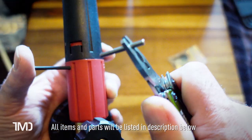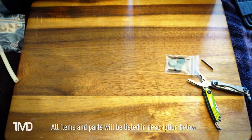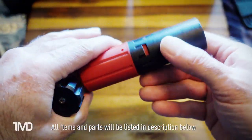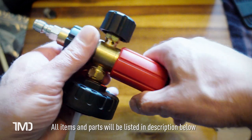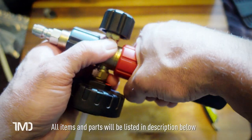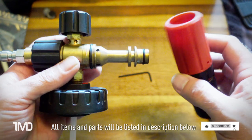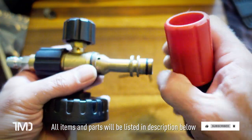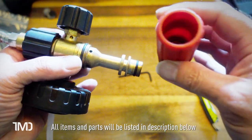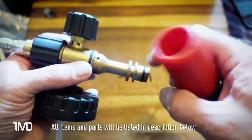Pull the pin out just like that. Make sure you set the pin aside so you don't lose it. Now that the linchpin is out of the barrel, grab at the base of the nozzle, hold onto the brass component, and twist back and forth while pulling. The nozzle isn't threaded — it's held on by a rubber O-ring at the base — so the plastic nozzle slides on and off with a little force.